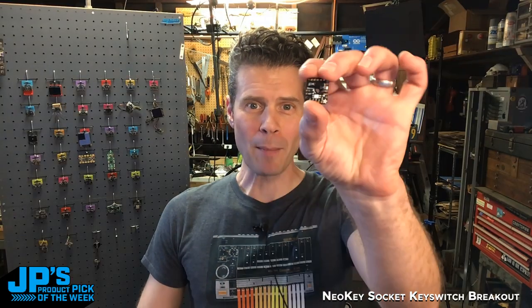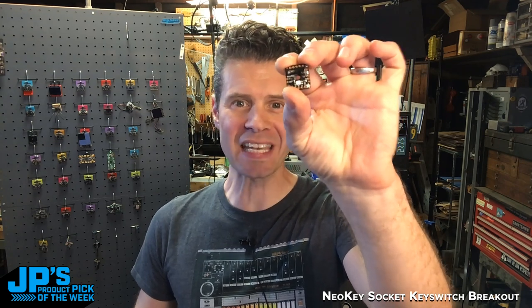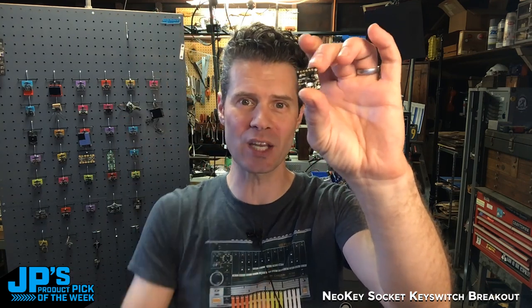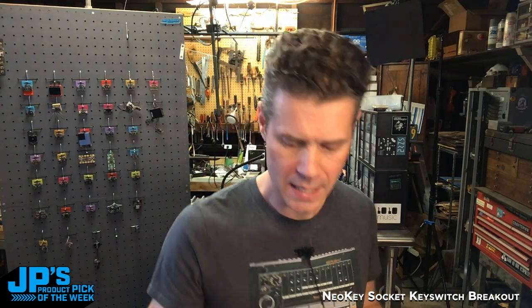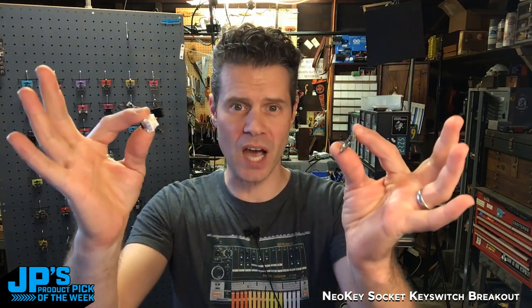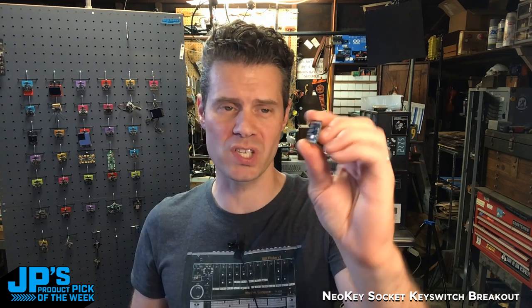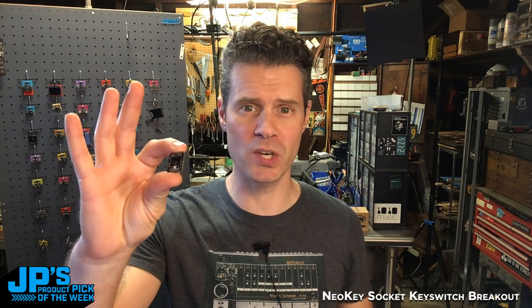Yes, there it is. My product pick of the week this week is the NeoKey socket breakout for mechanical key switches. It has a NeoPixel built into it so that it can underlight your keys. It has sockets so that you can push your mechanical key switch into it without soldering, and then you can try different switches out whenever you want. And it also has a diode built onto there to do diode matrices. And it has pins for soldering in headers so that you can plug it into a breadboard for prototyping. It is perfect for prototyping key switch arrangements.